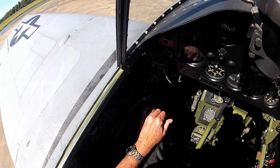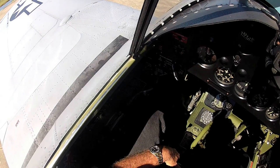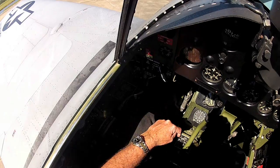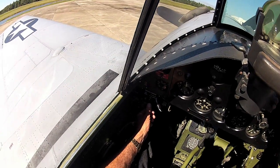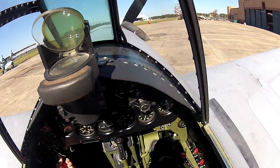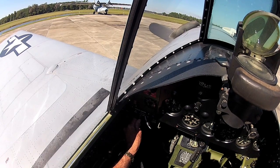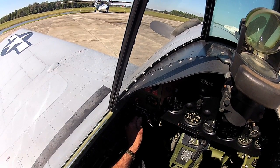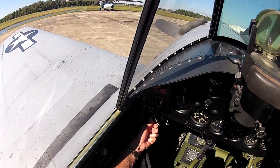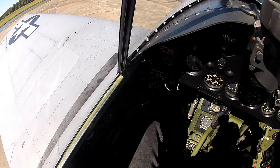So for takeoff, we have it full in. But if you watch this, I can go in the off position, and over here there's a decrease, and over here there's an increase position. So I can increase the pitch. If you listen to this, I can't hear it because I've got my headphones on, but it's changing the pitch of the propeller blade with the electrical motor. You can't do that with a hydromatic prop.